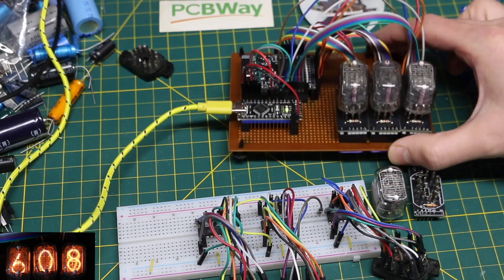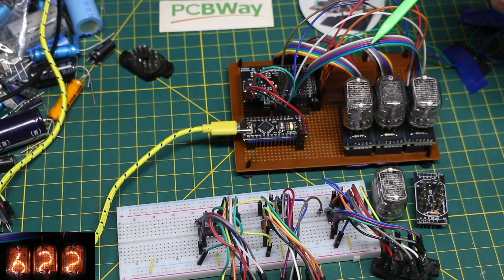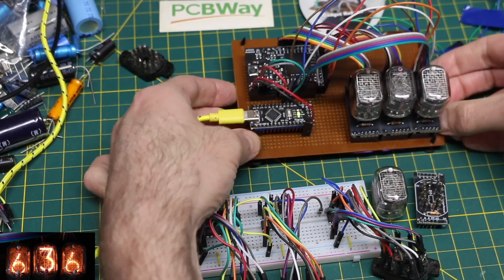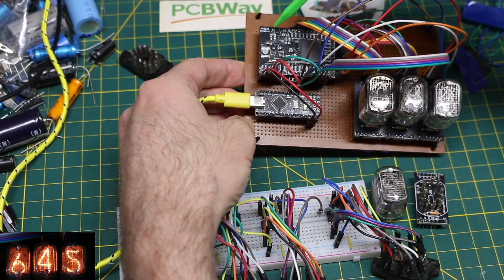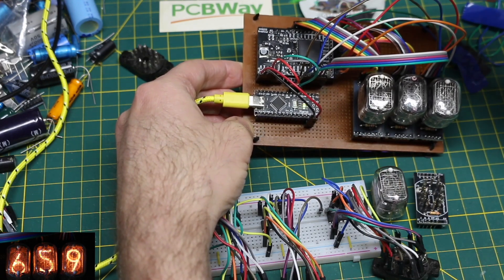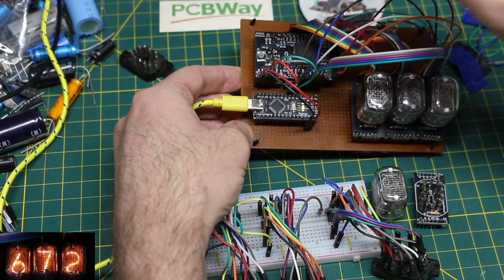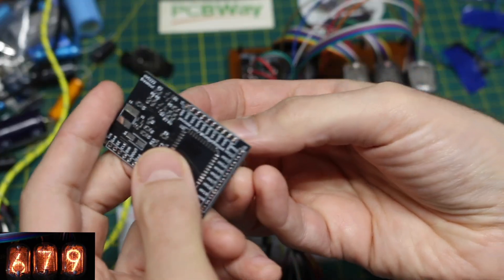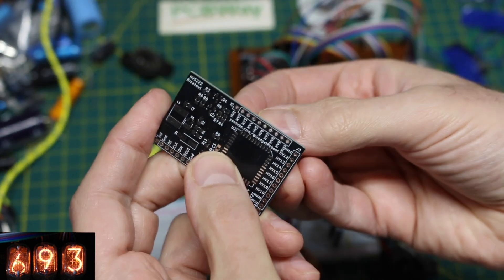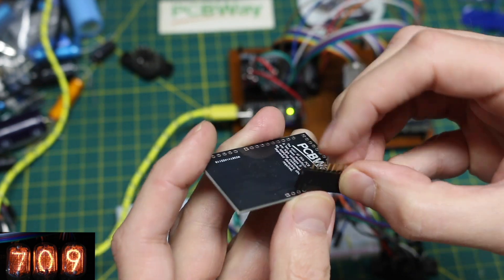I just wired up by hand as needed, and what I really made use of — I didn't want to run soldered wires for every connection. All the Nixie tubes still have DuPont wires going from the driver board over to the Nixie tube. Everything is taped down. Basically, on all of the headers going to the outputs, I put a duplicate socket header beside the board, and underneath they're just bridged over. So I have a duplicate set of pins and I just plug in the DuPont wire. I have male pins here that plug into a female socket on the board, but then there's a duplicate female socket beside it to plug in DuPont wires, and pin to pin is bridged over.